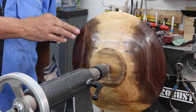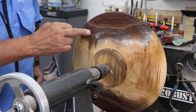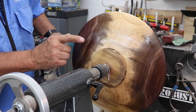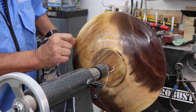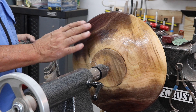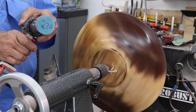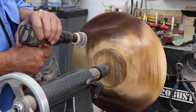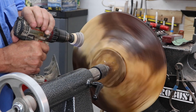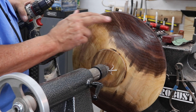Now I'm still in the procedure for finishing the bottom of my bowl. I've sealed it with shellac and I've got a very wet coat of that oil on there. I'm going to wet sand this a little bit — the reason for that is I had some really funky grain. It wasn't really torn but it was just kind of laying over on its side. I'm going to stabilize it and do a little wet sanding with 220 grit sandpaper to see if that helps. That feels a lot smoother — I'll continue with a little bit more wet sanding.